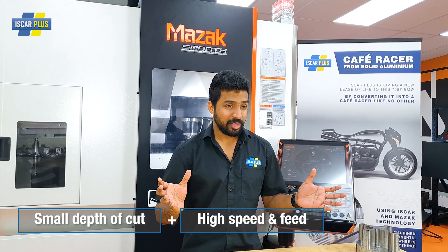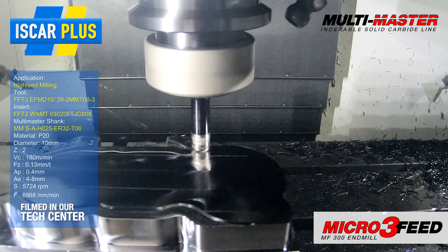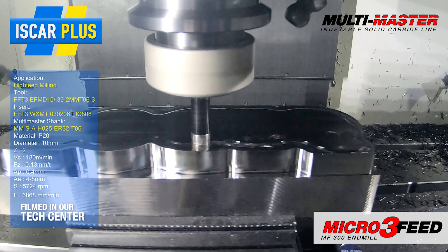On my right, you have the Micro 3F, which comes in a diameter range of 10mm to 16mm. So from 8mm to 10mm you've got the NAND 3F, and 10 to 16mm you've got the Micro 3F. Like the NAND, this also features a single-sided, three cutting edge insert with positive rake for smooth cutting. It is optimized for efficient chip turning and also features true coolant directed to each insert. These two cutters are also available in a multi-master form, screwed into an ER32 multi-master connection.